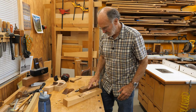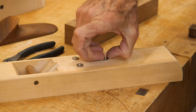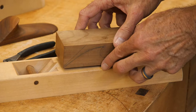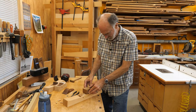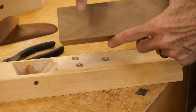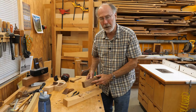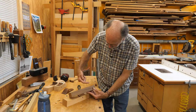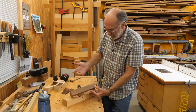I've got the dowel centers in place — I used pliers to hold them without pushing on the pin. I'll align the blank on top, slide it to miss the groove for the handle bolt, and eyeball it to make sure it's centered. After pushing down, I can see three very distinct dimples. I'll drill into those dimples, watching my profile to judge depth — the two front holes will be the same depth and the back one a little shallower. I set my depth stop on the drill press to stay well clear of my profile.